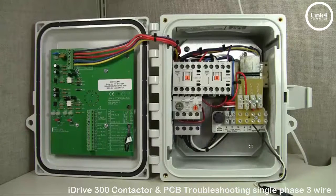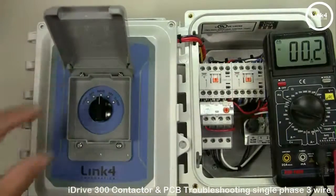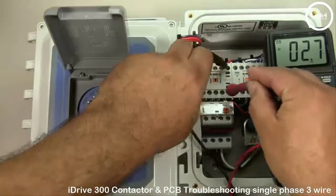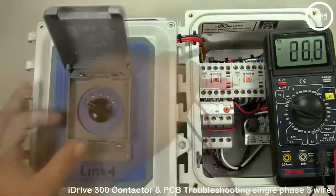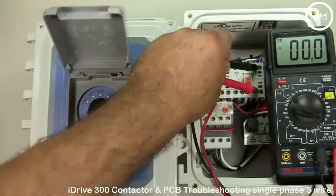For this example, we have simulated the open contactor working and the closed contactor being problematic. The first thing you want to do is meter the A1 and A2 locations on the contactors while the manual switch is in the open and closed positions. You should be reading 24-volt VAC or higher.